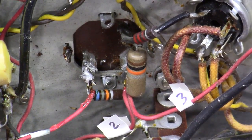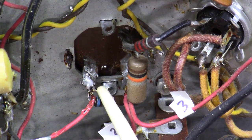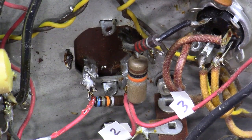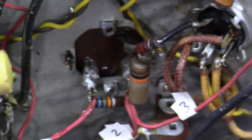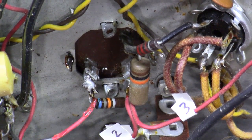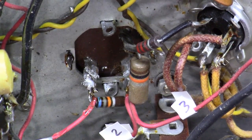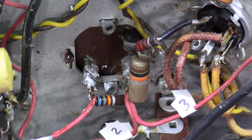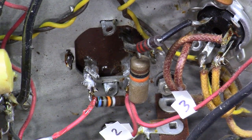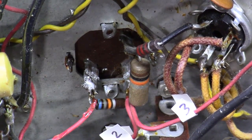All right, I have seen some people do an interesting trick before. What they do is they take all the wires going to a given tab like this, and then they come down here at the bottom and they clip the tab off at the very base where it goes into the capacitor. And they leave all those soldered connections together, and then they just solder this tab onto the tab of the new capacitor. I'm not a big fan of it myself, but functionally it seems to work okay. Could be a path you might want to go.